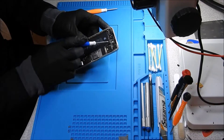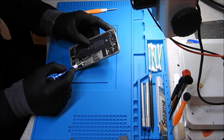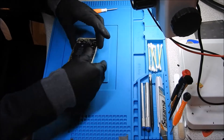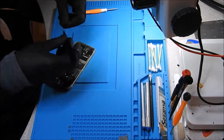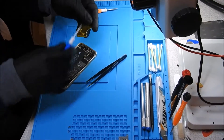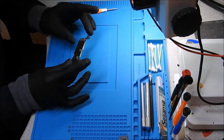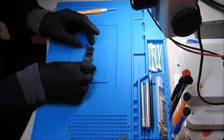The good news is this liquid trigger is not pink, and neither is this one. So if this is liquid damage, it must be very minor. This could be an easy one to fix if we can find out where the short is. Logic board is free, and before we remove the shields, this has zero signs of liquid damage.